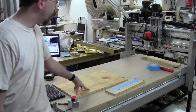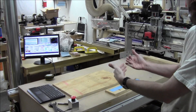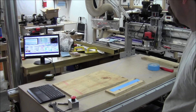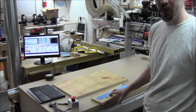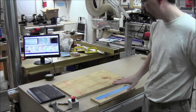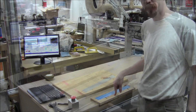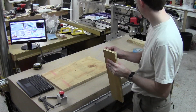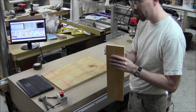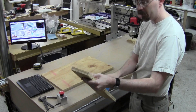The next thing I ran into is I need some way to reference the pieces I'm going to cut, since I'll be using this for more than one piece. What I thought I'd do is put this board down and build a fence that sticks to it so I can push my work piece up against it. Before I do that, I'll level this surface under manual control and then cut the fence edge to true it up with the X-axis, because the piece I'm cutting needs that reference.